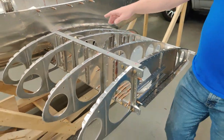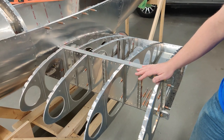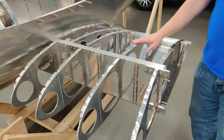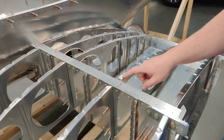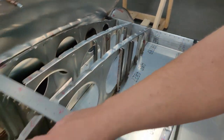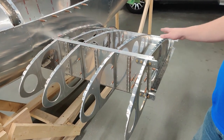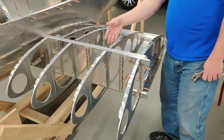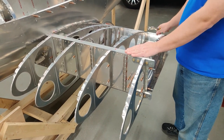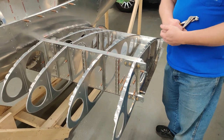The supports help when stepping on the wing. There's also the inside rib — I like to turn this rib the opposite direction because it makes it easier to reach in when you rivet it, though it doesn't matter, it's just a preference. When you put all this together, it's a good idea to label the ribs A, B, C, D, E, because when you put the skins on and drill all the holes, you want to put everything back where it was. Label absolutely everything. The holes are already in these because we've previously had the parts together — you can see the lines down the ribs, and that's how you line things up. Get the bottom skin on first — don't rivet anything yet, just cleco in place, line up the ribs through the holes, and punch them in.